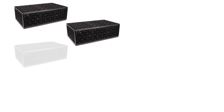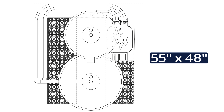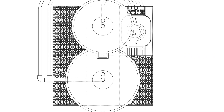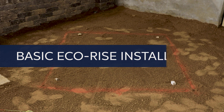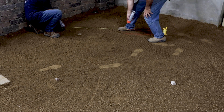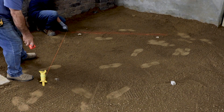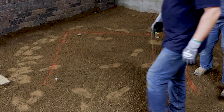A reservoir of five eco-blocks small with one PV 7500 pump vault, 48 inches wide by 55 inches long, is sufficient for single, tandem, and triple vase installations or bowl installations and many stone and column installs. Lay out the five eco-blocks and pump vault two blocks long by three blocks wide. The vault is typically located in the corner closest to the electrical service. Use stones or stakes at the corners, then mark or paint the line at least 12 inches wider and longer than the blocks and vault — 60 inches wide by 67 inches long — to allow ample space for backfilling.